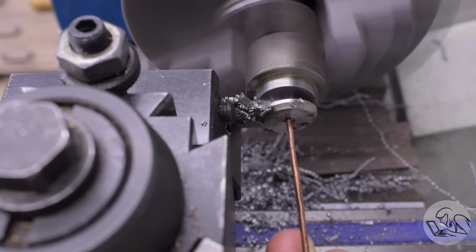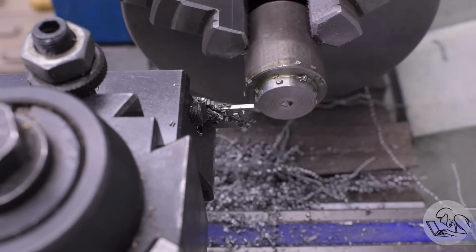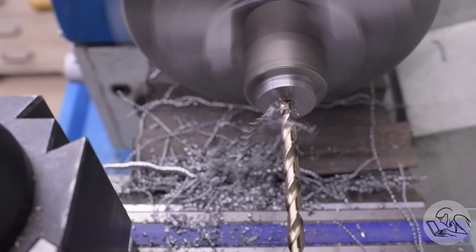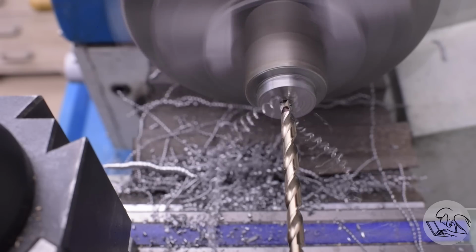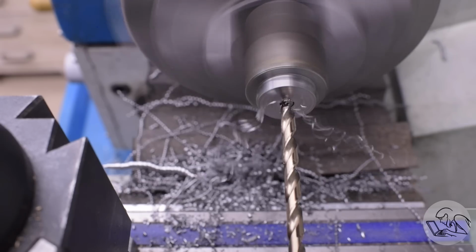And Yahtzee. Now the part that I thought was clever. The 4mm drill left a dimple after the parting, which I can now use to center the 5mm drill, which is of course larger, to drill out the second one. Saves me center drilling and possibly other setup. Sometimes I have a good order of operations idea. Not often, but it does happen.